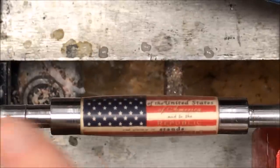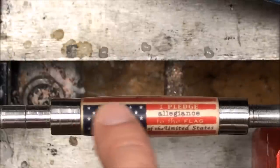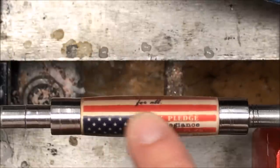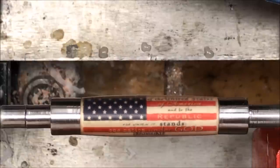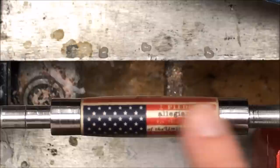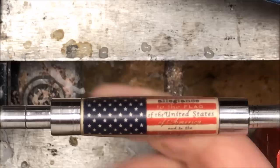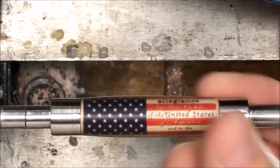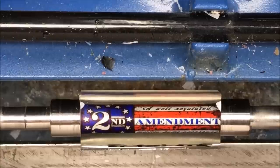Just finishing up with the final pad here on the second pass. I'll wipe this blank down a little bit. I did speed the lathe up a little — about 950. I'm watching my light above shine on the back of this blank and I can kind of watch that reflection line and usually see any flaws — things like scratches, pits, or grain — things that I want to fill or sand back off. And this blank is looking absolutely gorgeous. I'm not seeing any scratches. That second pass cleaned it right up. I'm going to go ahead and get this one off the lathe. That right there — that's a picture. Isn't that beautiful? That is a gorgeous blank.